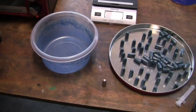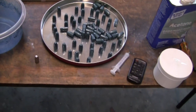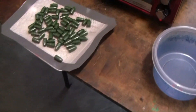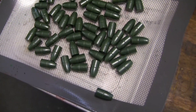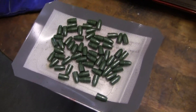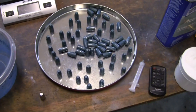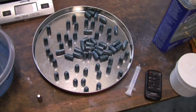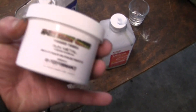The only advice I can give you is when you swirl in the mixture onto the bullets between coatings, make sure it's only 15 seconds and they're still kind of wet and coated all over — the coating evens out. It's just a little spot report. Not terrible. Let those cool off, then I'll test them later. A lot of work to get into doing this, but I guess the benefits pay off. Alright, so that's my little quick blip on the hi-tech bullet coating.